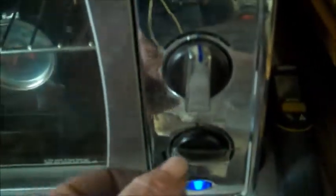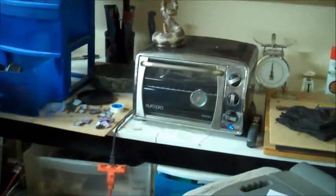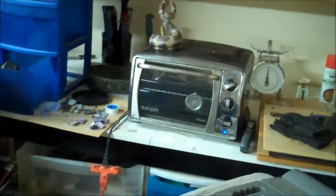So we're gonna put the blade in here, rest it in there on the rack. More centered. And we're going to put the timer on for 60 minutes. Bake. 400, you might even see that, but it's set at 400. Alright. So, we'll leave it in the oven for 1 hour. Let it cool down to room temperature. And again, for 400 at 1 hour. So, two cycles. And we'll be ready to do the final grind.